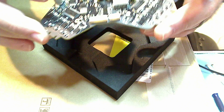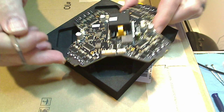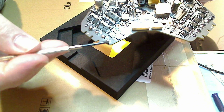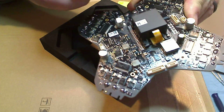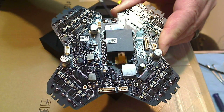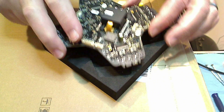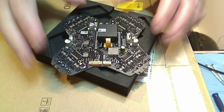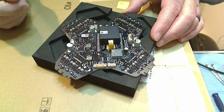We're back with the board — all the tabs are finally soldered. You basically go around each of the four sections of the board and add solder to the tabs all the way around. Don't forget to do the power section as well — that's your main power section here, and that's the only solder you have to add to the board. Once that's done, you're ready to insert the board into the unit and start attaching the wires to the solder joints.